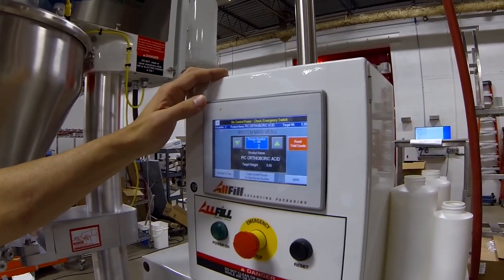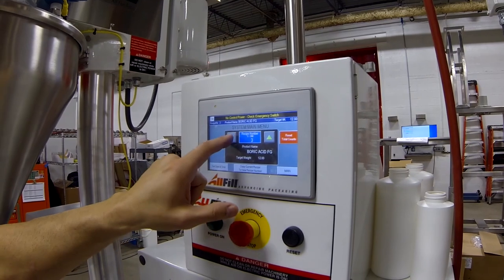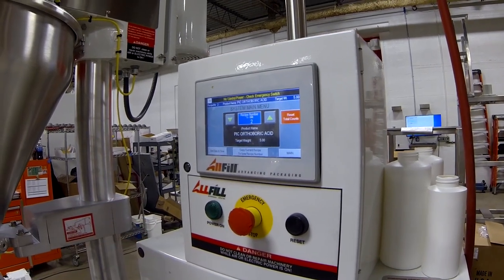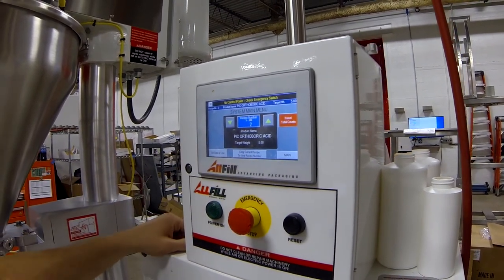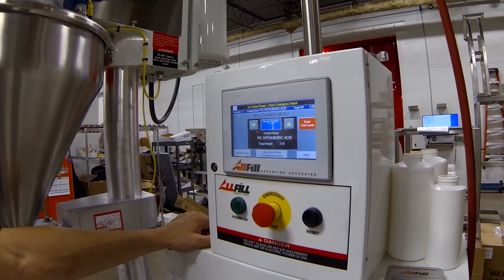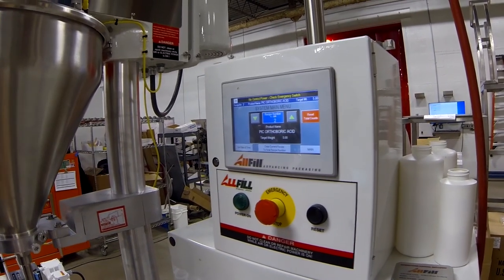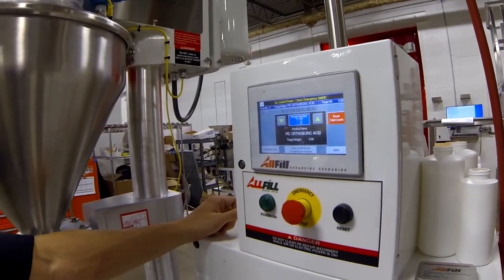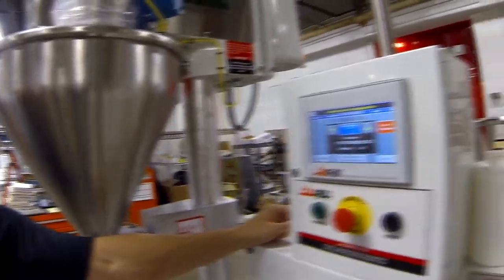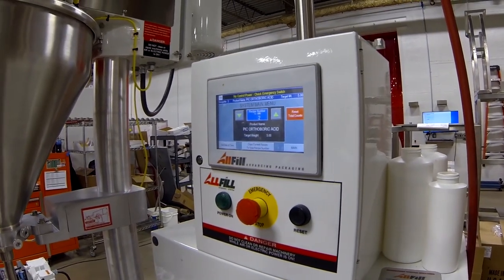System screen — here's where you would recall existing memory. You've got one to a hundred memories you can populate within here, and you can manually scroll through them or jump into one. Reset your total counts for the day — again, your production counter. You can copy new recipes: instead of having to go in and enter all the data — index time, conveyor speed, lift methods — you can copy a recipe, which gives you a bulk of the settings and then you adjust from there. So you can say copy recipe 2 to recipe 5. For example, if you have the 16-ounce and the 18-ounce in the same bottle, you can have two recipes and use that copy feature.